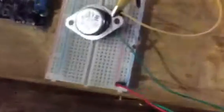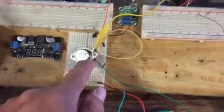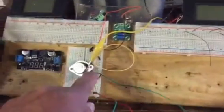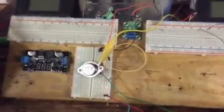Well, let's go over here and look at this setup. I got a 12-volt battery. It's going over here to a 2N3055. Also a resistor. What we're doing here is on the base of the 2N3055, you have the bottom lead of the secondary coming into the base, and then coming out of the base as well, I got a resistor, and that resistor goes into the positive leg.